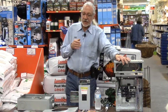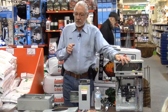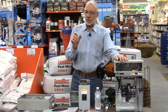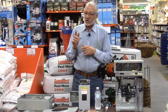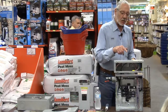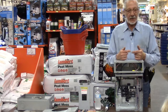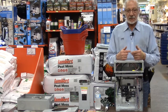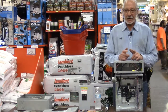Now, arc fault is measuring not a loss of voltage, mainly to ground. An arc fault is looking for a signature of arcing. That signature is going to cause the voltage to fluctuate, and there's electronic circuitry in that breaker and or the arc fault outlet that will recognize that arcing as it's looking at the hot and at the neutral. Okay, it's going to look and say, that voltage difference is available in both lines. That means that something in that line is arcing and it'll shut down.